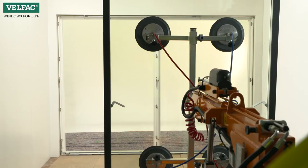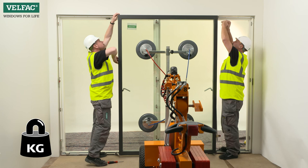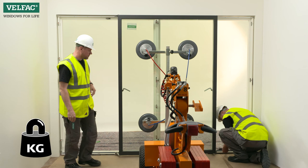During remounting, the opening sash should be installed before the fixed sash. Place the sliding trucks on the guide rail. The guide rod should be installed on the slider at the top first. Remounting should then be carried out in the reverse sequence to dismounting.